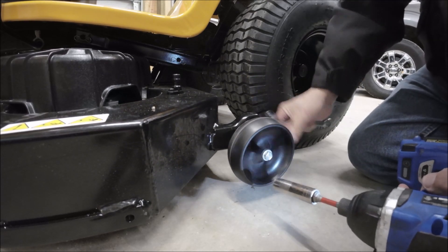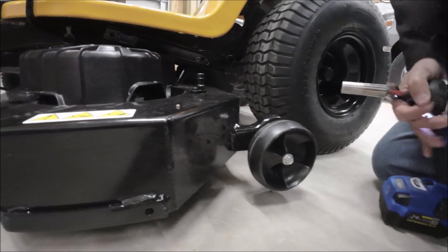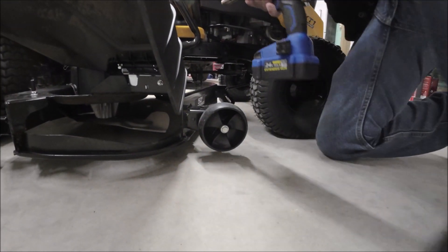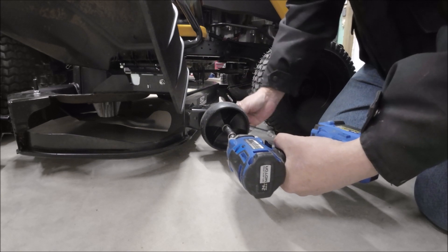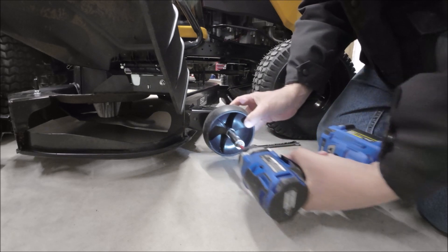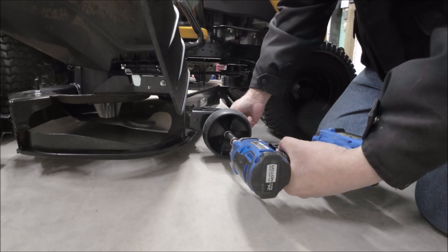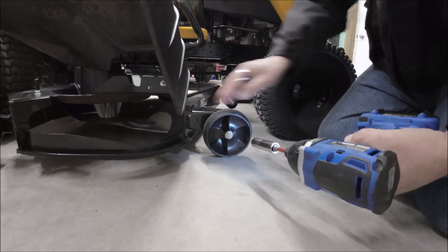Make sure it rotates. See now — I lowered it down. I'm at about a half inch here, slightly over. So we're going to do the same thing to the other side. Once you do this, you're pretty much all set, because people will use these and never adjust them — they leave them up. This one here is going to set about the same as the other side, which it does. Bear in mind these blades, when they're hanging, they sit with the front end low and the back high. That's how they're adjusted. Just like that.